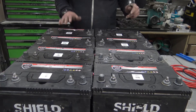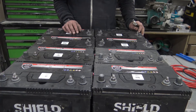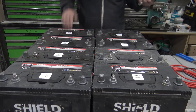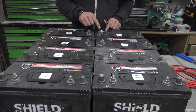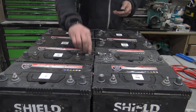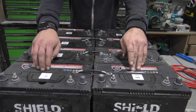So, we have 12 volt batteries — each one of these is 12 volts and for argument's sake they are 90 amp hours. I want to create a 24 volt system. In order to wire these up as one big battery, I need to connect them in series and then in parallel. So if I've got 12 volts and 12 volts, I connect those two together — positive to negative — and I have myself a 24 volt. Do that again and again and I have four 24 volt batteries.